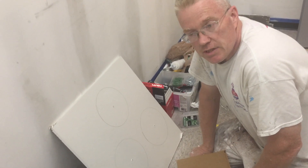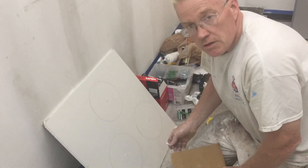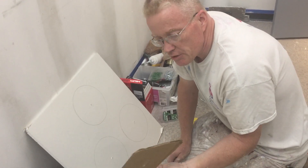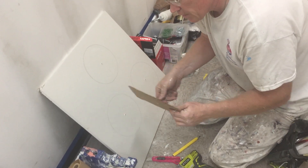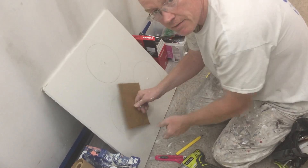So again, you measure your diameter of your circle — you have to measure it accurately, if you're off, no good. You measure the diameter and then you cut anything, it could be a piece of paper. I chose a piece of cardboard. This is 8 inches. Right in the middle of it, you put your screw. You screw it into the sheetrock, then you put your pencil outside and you just go around it.